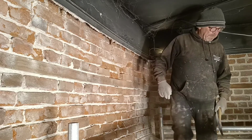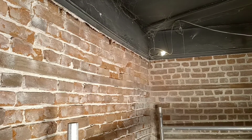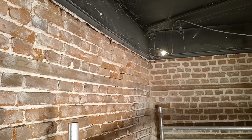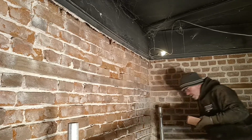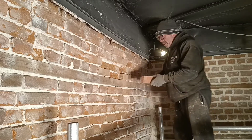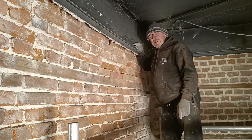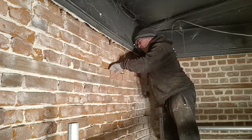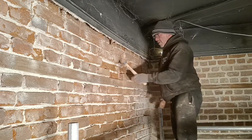That you're going to put in. See if I can find one for you. So that's the slip we're going to be using round around that. So that leaves me roughly 20mm of mortar behind the brick slip itself. Plenty enough. I've got a little bit of a high spot there. Right there, we've got a high spot, so I'll trim that.